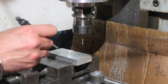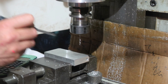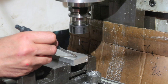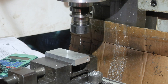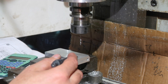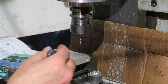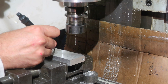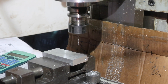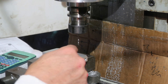What we're doing is making a right-angled triangle. This 72mm is the adjacent, x is the opposite, the hypotenuse, and alpha is the angle we're after. Tangent of the angle equals the opposite x over 72, which means that if we multiply the tangent by 72, we get x. So we multiply by 72, which equals 1.798 — basically 1.80mm in the y-direction.